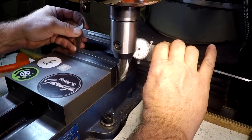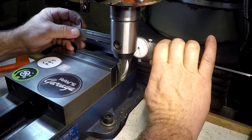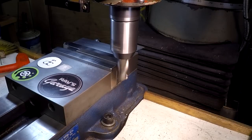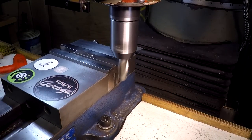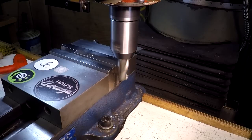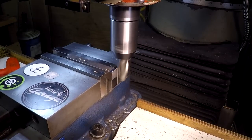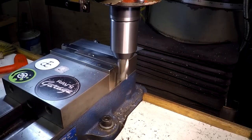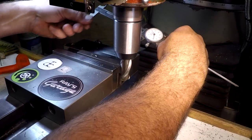Now I give this a measurement. I get a measurement now. It's cleaned up. I punch that number into the DRO and know exactly how much I need to go over for 4 1/4 inches. Makes it a pretty slick feature, just be able to punch that number in and know how much you got to take off. Came out right on the money at 4 1/4 even. Final measure, check.